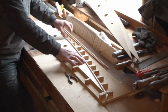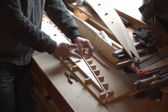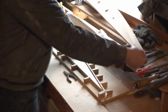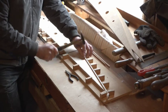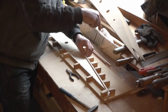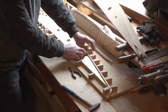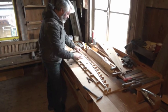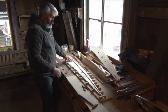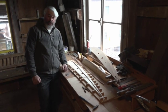The wrapped top cap strip will be placed on top and will be pushed against the wooden blocks. And now I can take the little hammer and just push the nails right through the rib web, right into the unwrapped cap strip on the other side. We will do this all around, and of course the same at the bottom. And when it comes out, it looks like the C1 rib I showed you at the beginning.